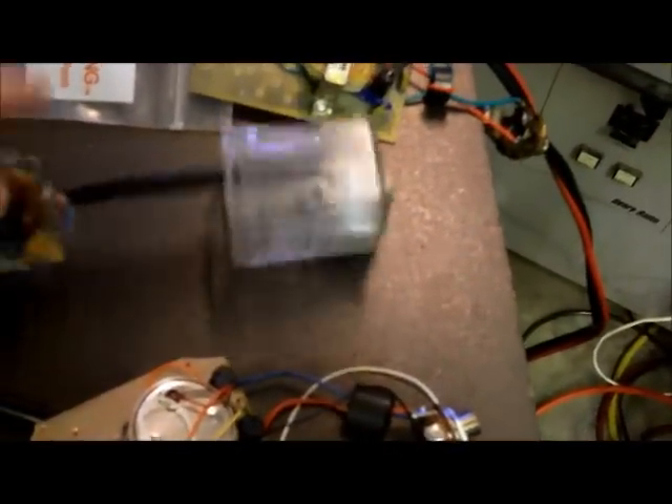They're one-to-one transformers, 600-ohm to 600-ohm, and they keep any hums, feedback, or squeals from coming through. You can get a bunch of these on eBay. I prefer to use this one because it has the best frequency response out of all of them — but it's a $75 filter. The one on here I bought from Mouser for about four or five bucks. This Hammond's transformer is good from about 50 Hz to 15,000 Hz and was in the $20 range. Each one has a different audio characteristic, and everybody seemed to like my economy version the most.